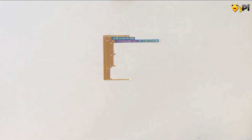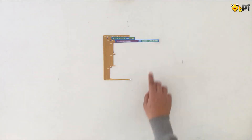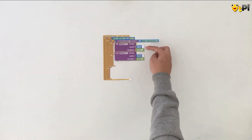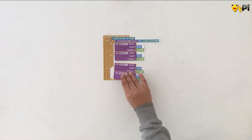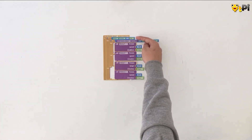I have used a slider in my designer to set a distance — your obstacle avoider needs to maintain a minimum distance from itself and any obstacle. If you would like to vary this distance during the obstacle avoider's path you can use a slider; otherwise you could grab a text element and add a hard-coded number. So if the distance between my ultrasonic sensor and any object is lesser than the threshold value of my slider, I am going to make it take a turn. Remember, this block turns my obstacle avoider because both wheels are going at different speeds. If that's not true, my obstacle avoider just moves forward. Now we are done with this block — let's program the else for the checkbox block.